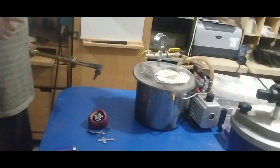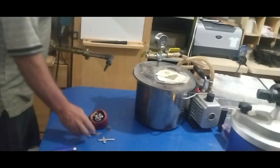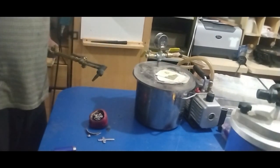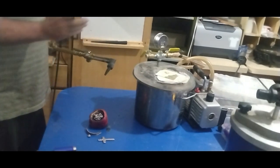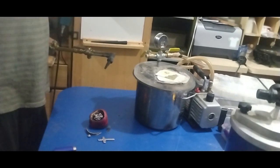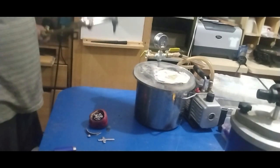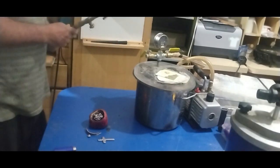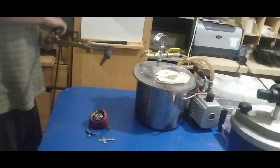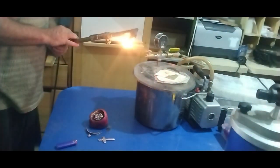I got my mold over there in my burnout oven ready to take out, and I've got my casting machine here and some scrap silver right here. I'm going to melt this silver, then get my mold, put it on the vacuum, and see if we can get this mold casted. It's a little bit of a dance doing this because my burnout oven is a little bit further away than normal. You've got to have this mold really hot when you cast it — if your mold cools down there's a chance you might not get a good cast.